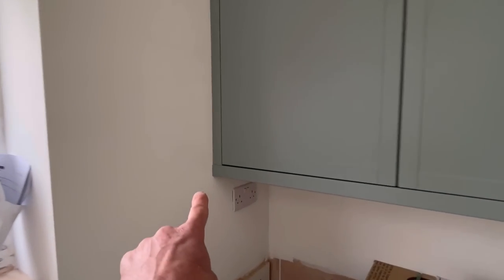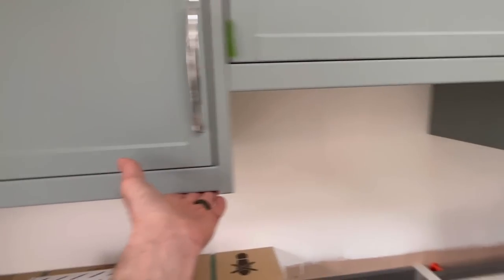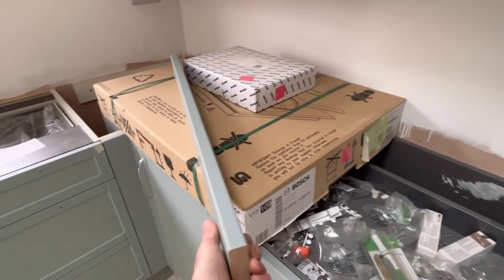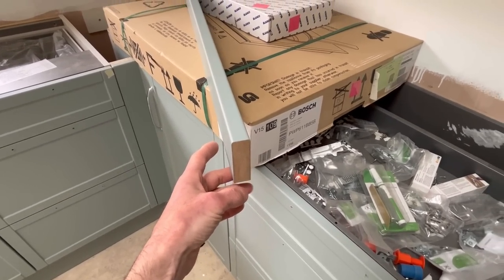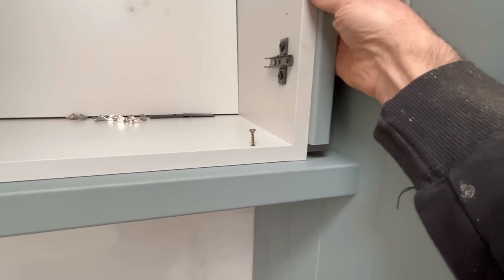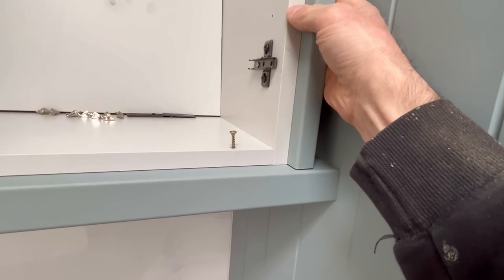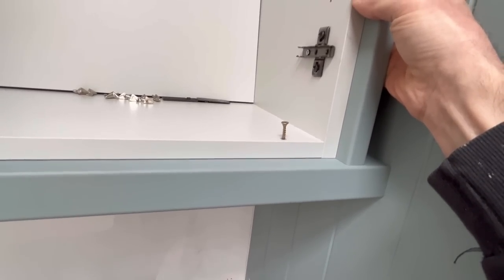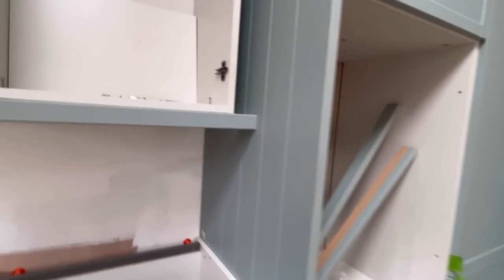So there we are, but we've got over it anyway because we're going to match this side. The panel's going to come down onto the pelmet like that to match that anyway. So I'm going to use some of this. It is the same panel thickness, but it's just not got a manufactured edge on it. If I move that, to mirror that, it'll sit, and I've got to be careful because that's not fixed yet. It'll just sit on top of there, 20mm forward, like that instead. So that'll look tidy. I've got to move that bit of pelmet in a little bit. The edge, all bar the 10mm at the back, won't be seen, unless you get your head right in there, which you're going to see anyway.